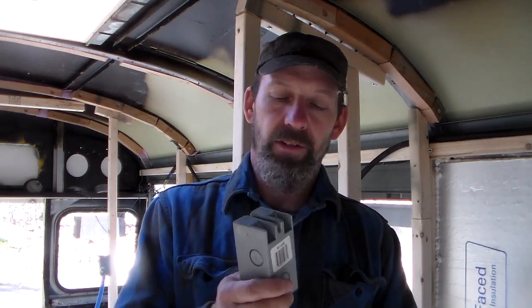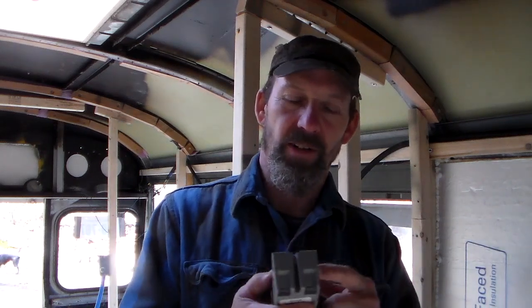Of course, the boxes that are kind of thin like this allow me to sort of just barely go by the 2x2, and then have the sheathing on the front of it. And so the ones with the tabs and the knockouts are like $6 a piece, and that was really annoying to me. And these were $1 a piece. And I'm all about value, and I don't mind spending extra money when it's worth it for the value. In fact, I'll talk about that a little bit later when I get into the wiring. But I felt gouged to pay $6 for a box just because it's got the tab on the side. So I've just been drilling holes and taking drywall screws and drilling them right into the studs that way. So that's how I'm going to deal with that.